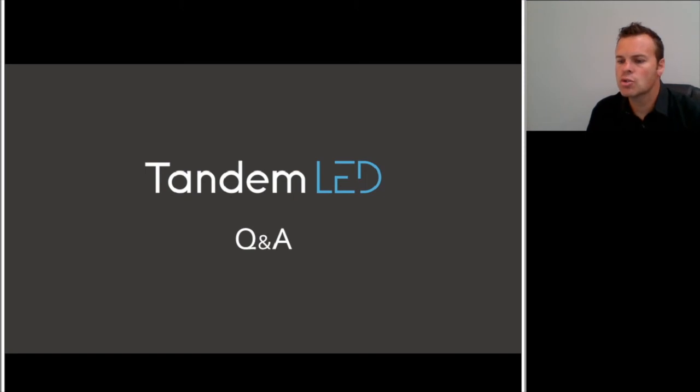So can the light also change colors like a color wheel? So for RGB lighting, or like the red, green, blue lighting that you can change to multiple different colors, we also do have a receiver for that. It's our RGB receiver that is also smart home controllable, and that does the color changing lights with static white included in that, meaning that you can get around a 5,000 Kelvin temperature white out of that tape as well.